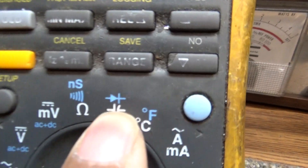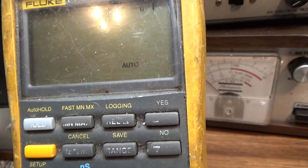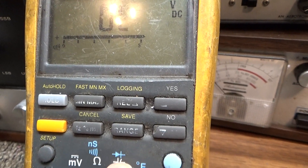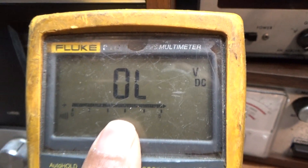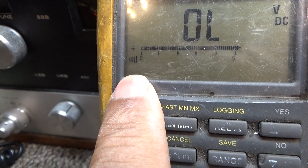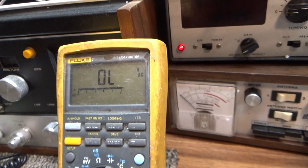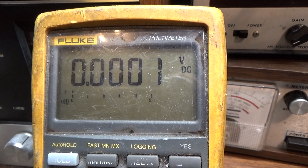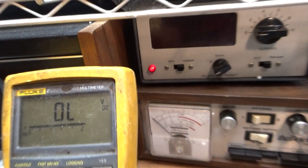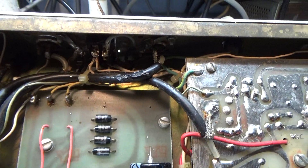You don't have to worry about getting electrocuted. If you have a meter, put it on diode — that's the blue symbol. I had to hit it again to get to the blue diode setting. On diode test you'll see a screen with OL and a positive reading; this one has sound. If you touch the leads together it will read something like 0000 and make a noise, indicating a dead short. The OL indicates open.